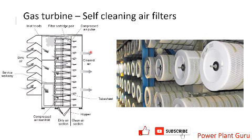What we saw in the last slide — here is the detail picture for that. This is how the air filters look when viewed from the dirty air side. This is a circular peripheral surface where air comes from all angles and goes to the inside of the filter. There is a hollow passage section inside the filter, so air comes from outside and goes in, and dust particles get stuck on the outer surface so that dust does not go inside.